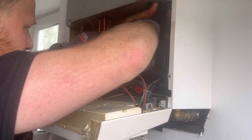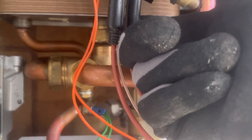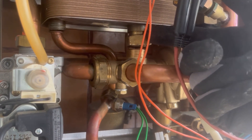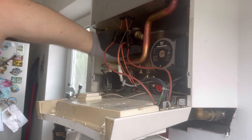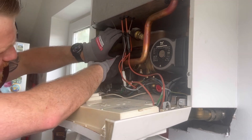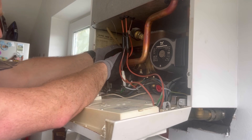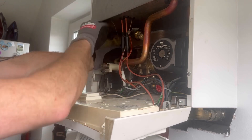I've got that one on, but I'll line that one up - back one in place - and that one won't go in place. So let's try and get that one on. When I have done these in the past I've had trouble lining all the nuts back up - it can be a bit of a pain. What I was recommended is to loosely connect the nuts first - just get them on a few turns each, don't tighten them up until you know you've got them all in. It should make it a little bit easier.